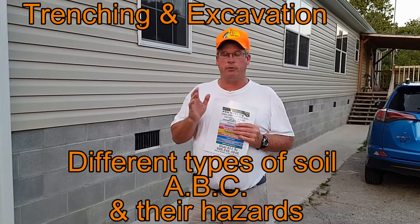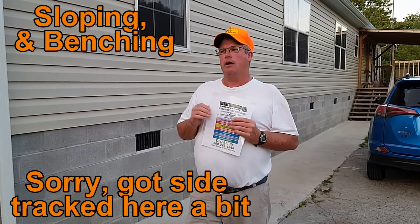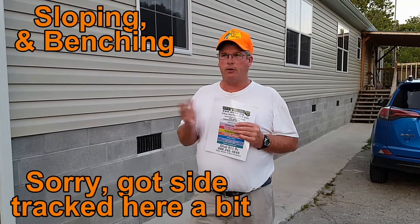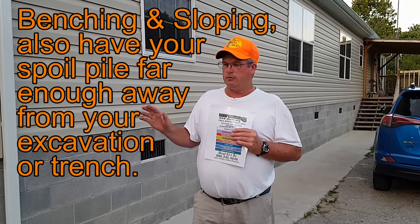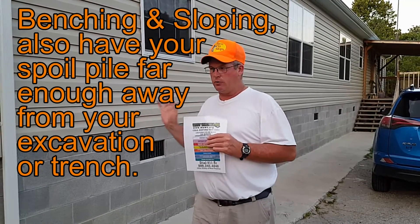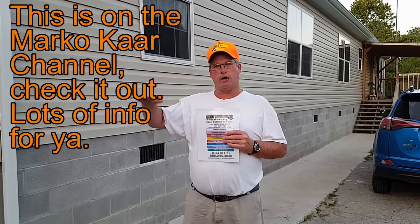What am I talking about? Like I said, you operators do this on a daily basis, you know exactly what I'm talking about. Watch the videos to find out more. Depending on what kind of soil you have when you're digging with an excavator or backhoe — like my little tractor, they would call it a rubber tire backhoe or rubber tire excavator, here we call it a backhoe. But anything that you put into the ground, be careful. The more sandy the soil is, you would dig away from it in a V shape. There's been a lot of people killed by putting the spoil right there beside the ditch — that's a bad thing to do. The reason why is it puts weight on it, it becomes unstable and will shift.